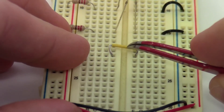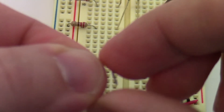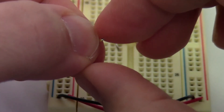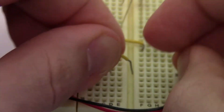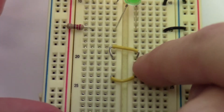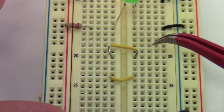If you are using pre-cut wires and want a wire to be flush against the breadboard spanning a certain length, a better way is to first bend the wire straight, then bend it into a U-shape. That gives you a better ability to get the metal all the way in. Then if you want it flat, you can bend the wire sideways a little bit. Watch out for this when working with younger students because you're not going to have a good electrical contact otherwise.